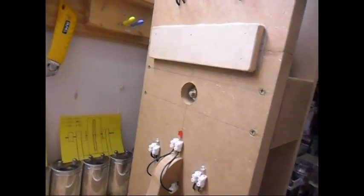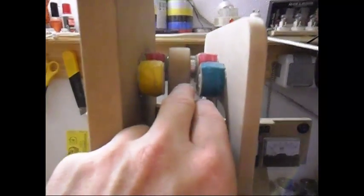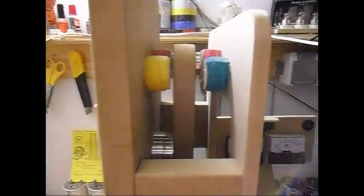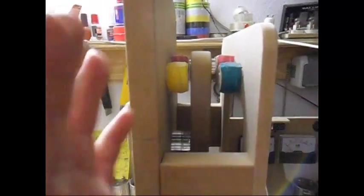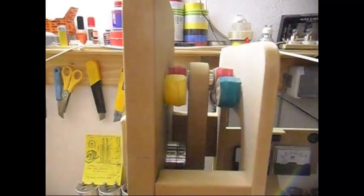There is the back side of it, very simple. I am using a video head bearing — very nice. I have very large neodymium magnets over there, because the movement is not that fast, so you need a lot of magnetic field to produce a little bit of energy.